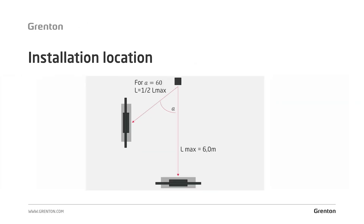It is safest and most optimal to measure CO2 at that height. If instead of reading sensor parameters the most important thing for you is to control your RTV equipment, then you can mount the module under the ceiling, or even on the ceiling itself. The maximum range of the IR transmitter is about 6 meters — however, remember that this is a straight-line range. If your module controls a device on a perpendicular wall, the range will be shortened. At an angle of approximately 60 degrees to the module, the range will be reduced to approximately half of the maximum distance.